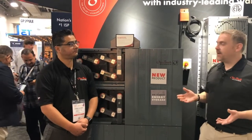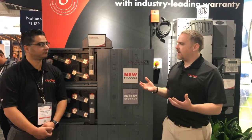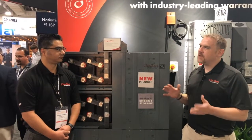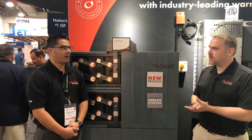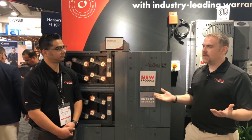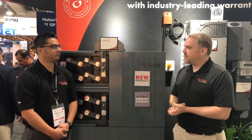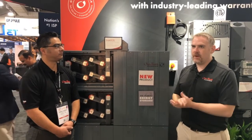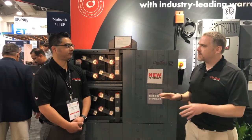One of the things I've learned about this product is you're often trying to figure out how much it's going to cost to have this battery cycle. Because you have such a high number of cycles, what is the cost per kilowatt hour over the lifetime of the product? It's about 16 cents per kilowatt hour. So if you're somewhere paying 25 cents, because you have the panels and equipment doing self-consumption, you can offset that. Anywhere from 20 to 25 cents, it could make sense to choose self-consumption with this solution.